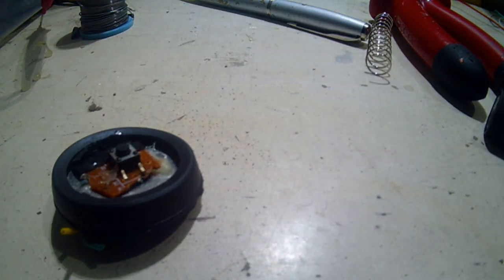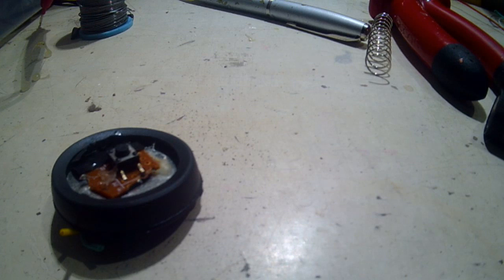Now, before we head to the final assembly, remember to isolate the contacts of the switch from the spring that will be on top of it. For the final assembly, set up the spring on top of the switch and then put on top of it the bottle cap and secure it, putting its edge inside the top walls of the o-ring.